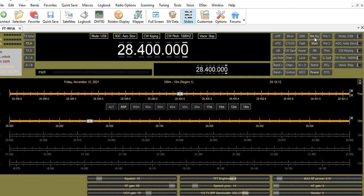Audio test: one, two, three, four. Now I'm going to go ahead and turn on the processor. Now I have the speech processor on. Audio test: one, two, three, four. KI5JUF testing with the M100 microphone with the ceramic, dynamic, and low cut filters on, with the microphone equalizer on and the processor on. The mic gain is set to 23. KI5JUF.